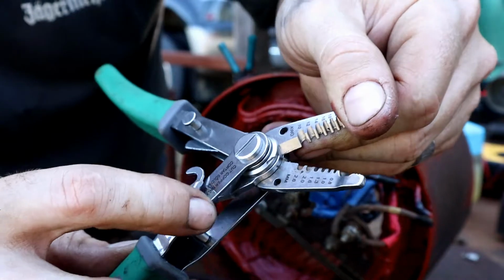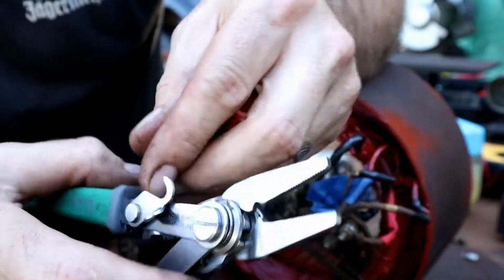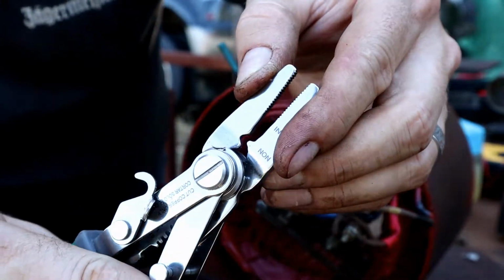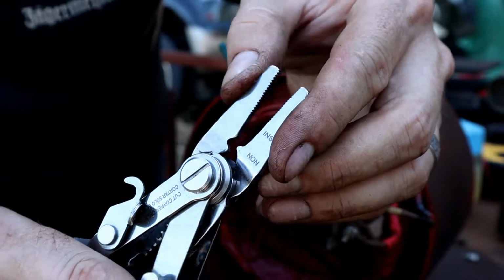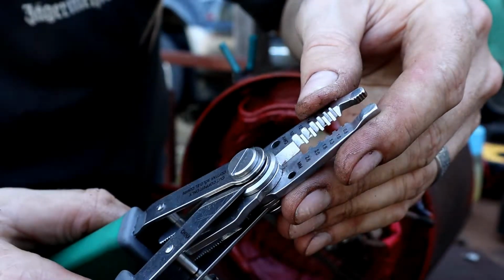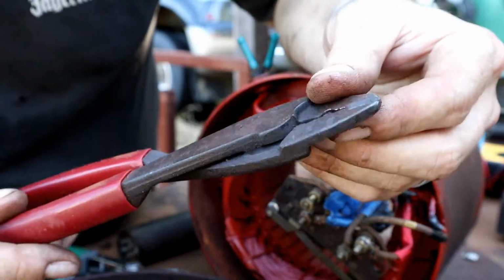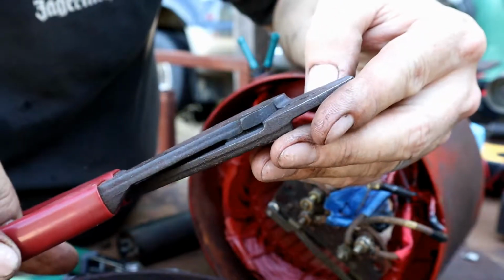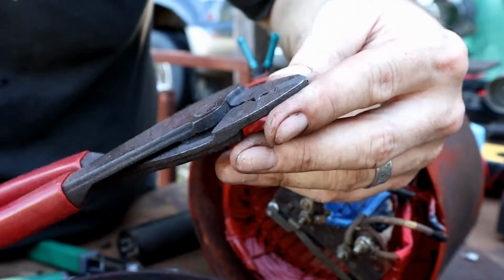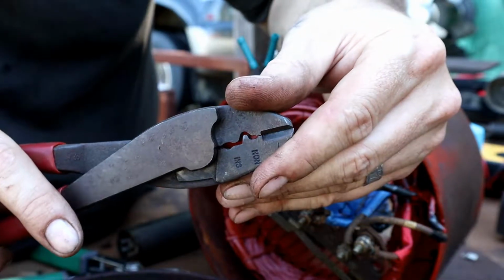I mean, it's got this nice nickel finish on it. It's got your gauges on it. Very, very nice stripper. But when you go to use your crimp side, it deflects and it does not crimp on center. And it screws the crimp all up. So I use them for the stripping purpose, but that is it. So for the crimper, the best one you can get right here for a wire crimper, this one is unbranded, but it'll have these red handles and just a really nice crimping unit there. And you use the crimper that's got that big detent area, and that's going to crimp your wire really nice and tight.